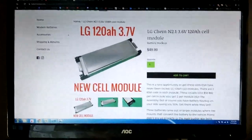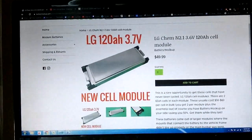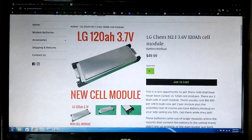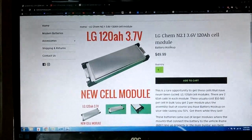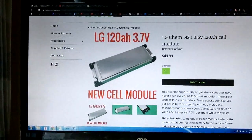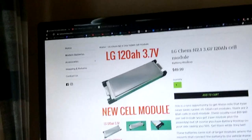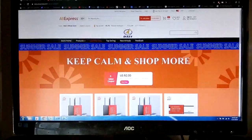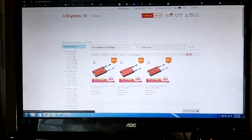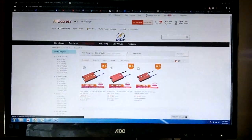And the reason why I'm doing that is twofold. The first is this is my first time building a battery from raw cells and a BMS. So I didn't want to do it with a 57.6 volt 16S in series, because I think all those wires would be really confusing for me, and there's just more room for messing up. And if you mess up with something like that, it's gonna be a pretty big mess up in terms of the consequences. So that's why I did that.